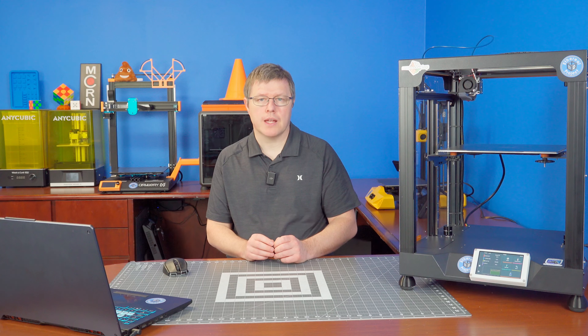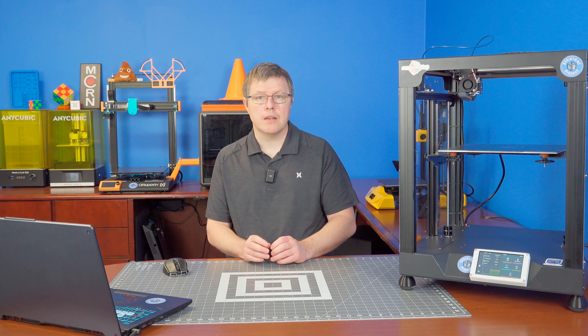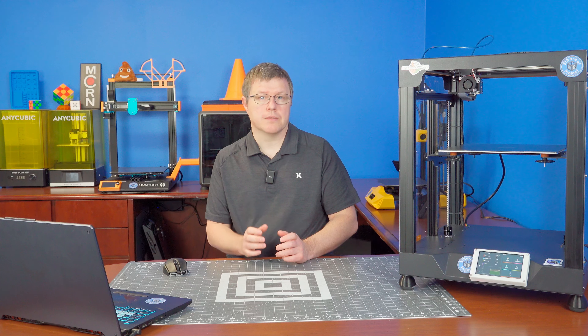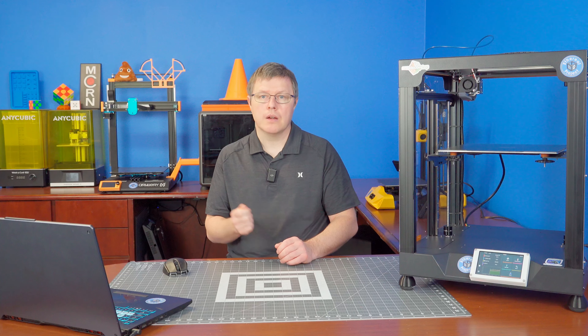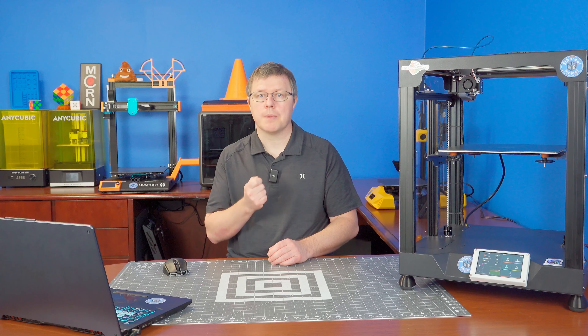Using the onboard storage has two big advantages. One, it frees up an SD card. And two — and this is the big one — you could set up your entire installation on that microSD card until everything works perfectly fine, loading your configurations, get it all working just fine. Then you could load that data straight to the eMMC, and then you have that SD card still unchanged, which could be a good hard backup of all your data and configurations. If something ever happens — it gets corrupted, power lost — you have a good backup that you could just plug in, reflash the eMMC, and you're good to go. No fiddling around with trying to find your configs. You have a hard copy that you can keep stored somewhere.